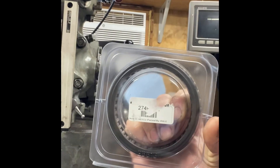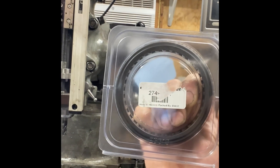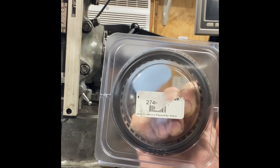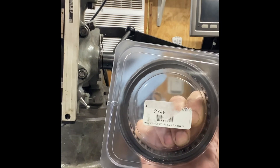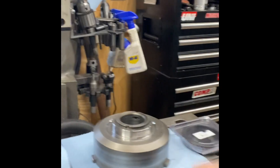I'll start off by showing you the package. It was about $100 from the place I bought it, advertised as a 36-element sprag for a Turbo 350. I looked it up on the internet and it's actually a sprag for a 4T80E, and you can find them for about $40. So for $40 and some machining time, you could have a 36-element sprag on your Turbo 350.